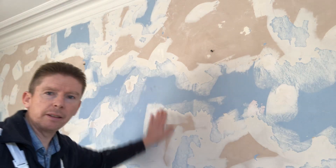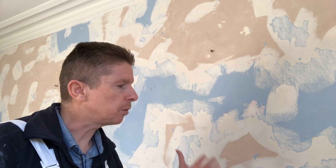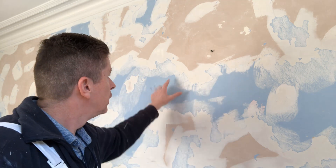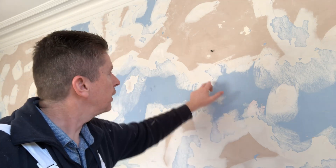I'll just turn the video around here a second and let you see what I had to do to this wall. As you can see, the preparation — there was a bit on this wall. When the paper came off, I've done a video on paint coming off walls, bubbles and stuff. Basically what I've done was when I stripped it, let the wall dry off, scraped all the loose paint away. After I scraped all the paint away I gave the wall a sand and filled the edge.